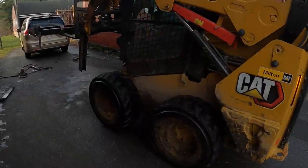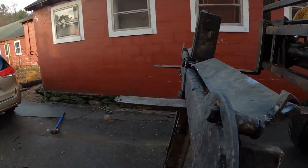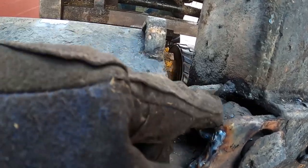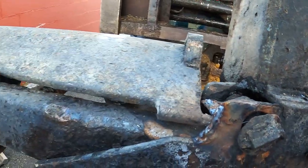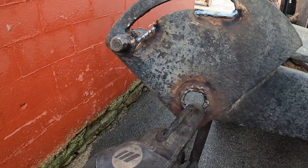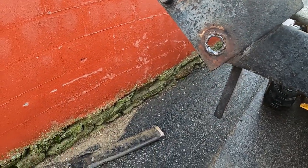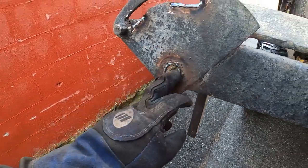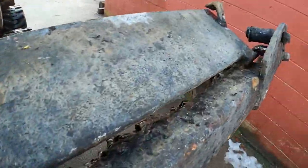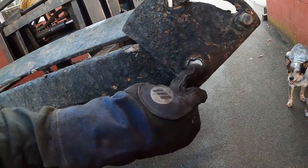So, if you guys remember, I said I had to weld something a few videos back and I never got around to it. So these are the alley scrapers to the actual barn. And what was happening was, when it went to reverse, this was worn enough right in here that it would slide up and it would pop out, and then they would leave the sled, and then the sled would be there and it wouldn't be there, along with these pins are worn, which wasn't a huge thing, but eventually they were gonna fall out. So, rewelded those, reinforced this side, reinforced the rods, reinforced that.